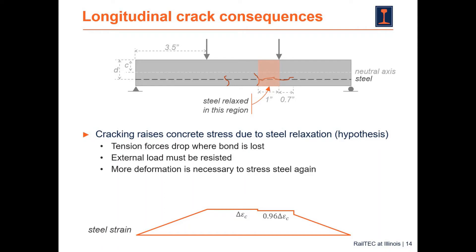Because of this additional bending, the compressive stresses in the concrete also increase. And eventually, the fatigue life of the concrete could be reduced because of the higher stress levels.